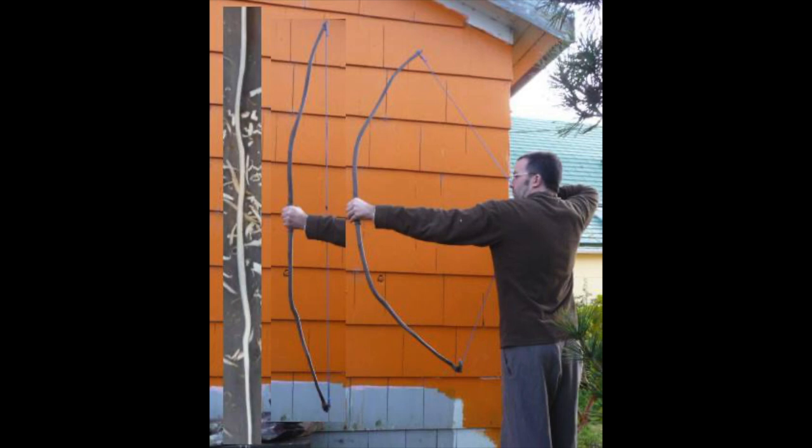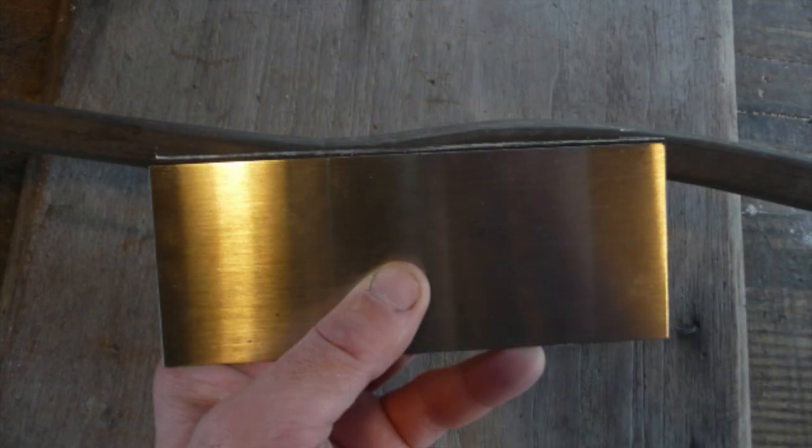Next, let's cover my friend Aaron G. Webster's no-guess tillering method. This method has a huge advantage, which is that it's perfectly suited to character staves loaded with bends and wiggles. If you're interested, I linked a detailed post about this in the video description. The gist of the method is that a straight edge is used to draw short straight lines along the side of the bow.